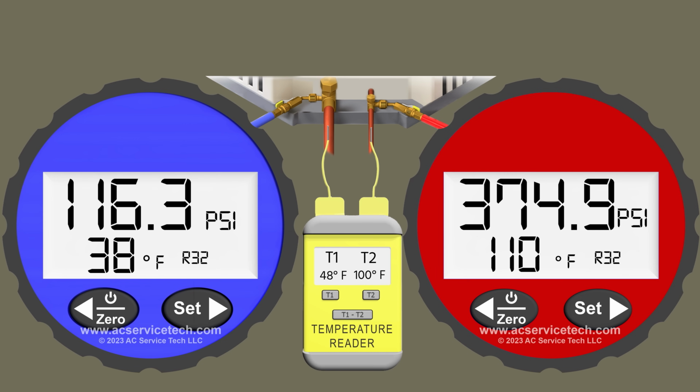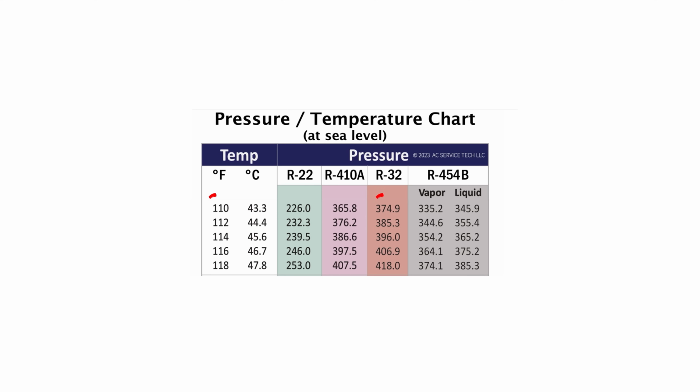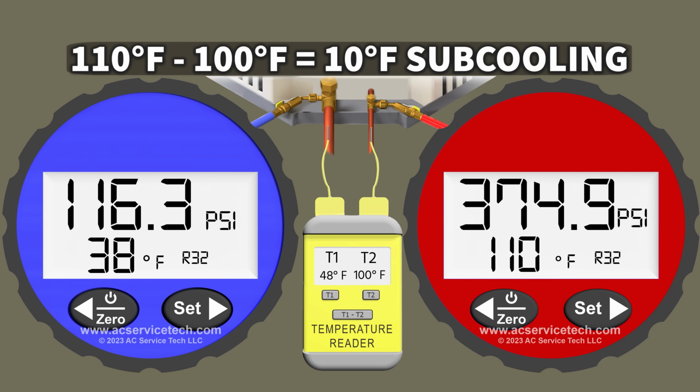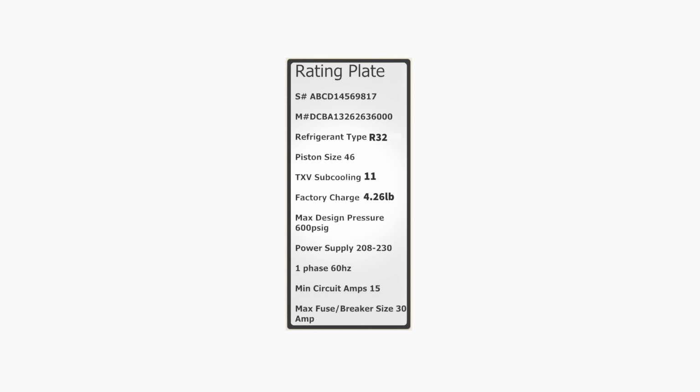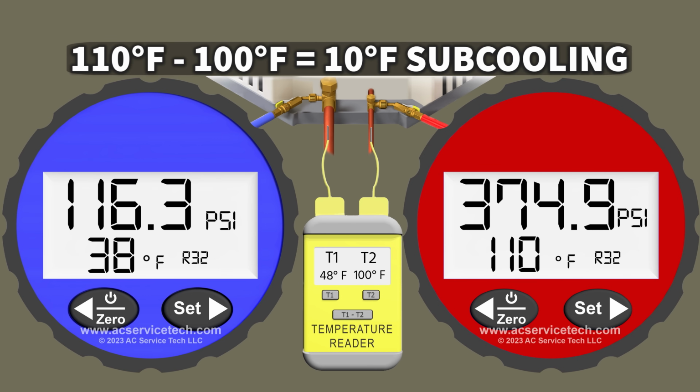Now let's go ahead and take a look at the liquid line. The liquid pressure is 374.9, and that converts to a saturated temperature of 110. We also have a temperature measurement on the liquid line, and we're measuring 100 degrees. So we take 110 minus 100, and that's 10 degrees of subcooling. On the rating plate of this outdoor air conditioning system, it says that the target subcooling is 11 degrees. So since we're within, say, plus or minus 3 degrees of the target, that means that we're accurately charged.